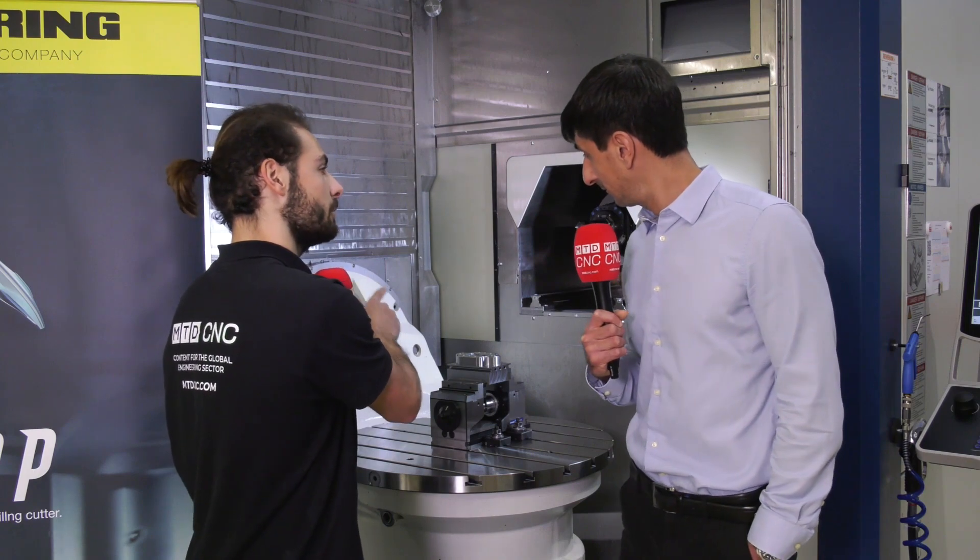You were doing some reaming operations. Why are you doing that? Would you normally use this drill before a reaming operation because it's got high tolerance? Yes — it's just a go-to higher performance drill for steels. You can run a lot quicker with this drill compared to our traditional universal drill which we would have used before on steels. So if you want to reduce cycle times on any steel material, you pick your XF.